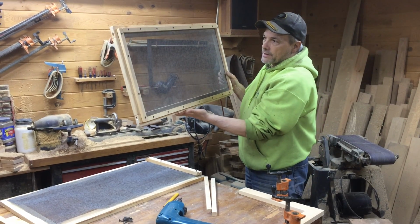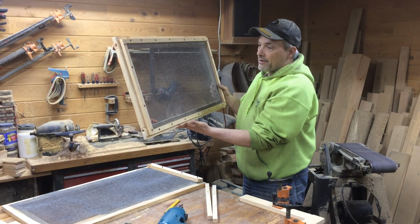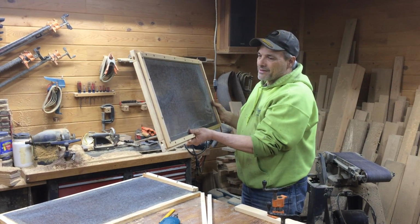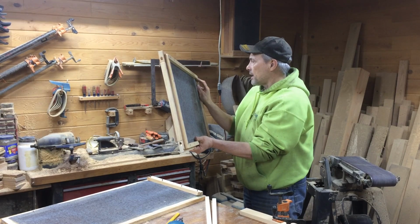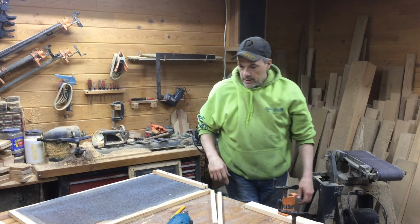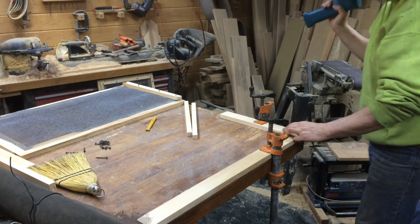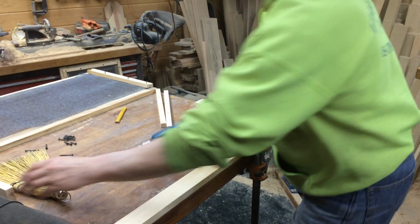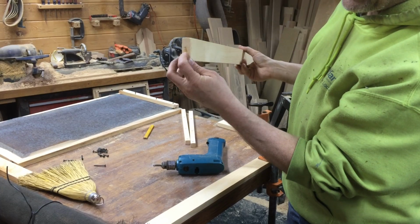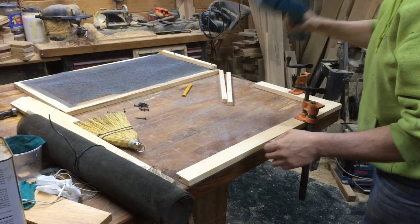So the thing is, we have 6 windows in the basement, but 3 of them I caulked solid. I couldn't get them open anyways, and I don't want air coming in, and I don't need 6 to open anyway. So 3 are caulked, and there's 3 that we need screens for. So what I did was I tried to think of the easiest design, which would be still functional. And what I came up with is make 4 pieces for the outer edge and countersink the holes like this. And that way there's just one screw that goes in.